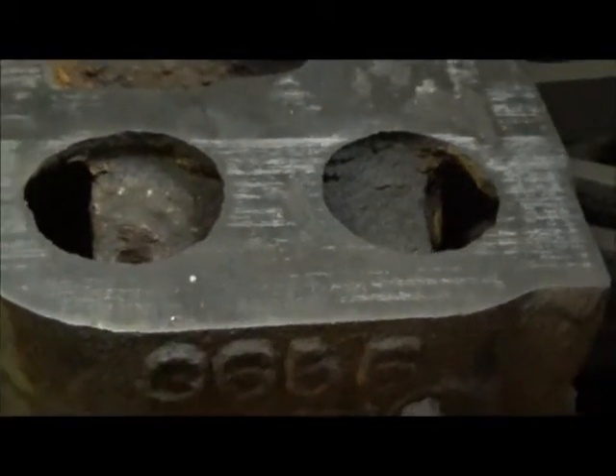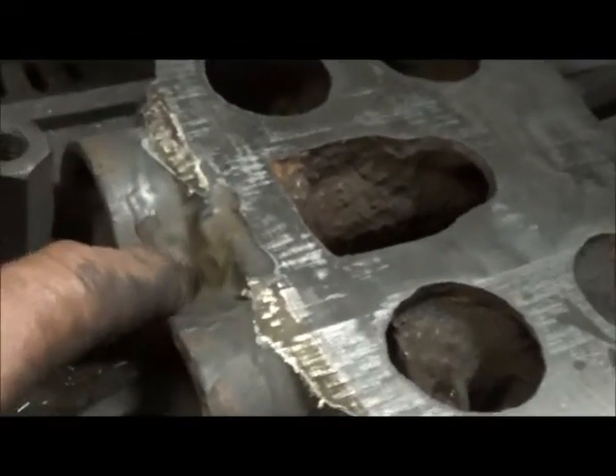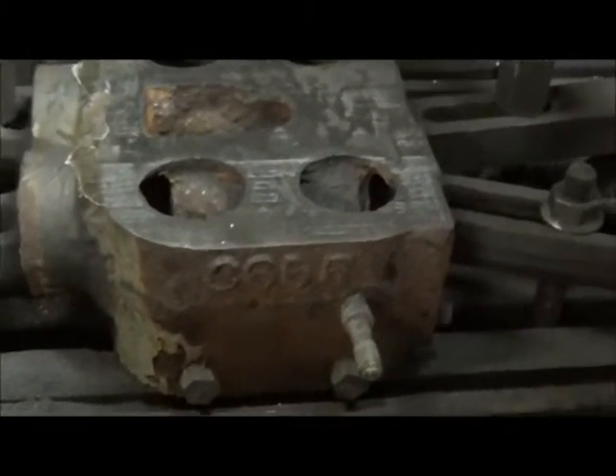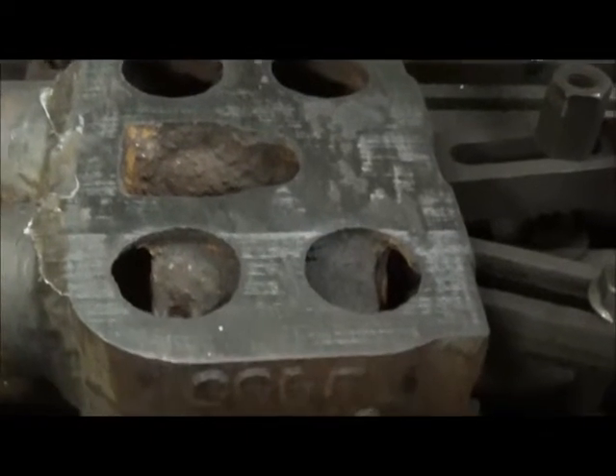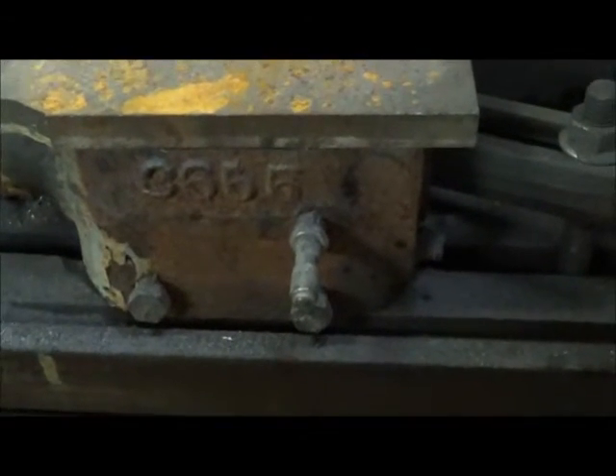I think they've done a really good job of brazing that in — I don't know why they had JB Weld over it, I don't see how it could have leaked. They actually done a real good job. We're going to leave it at that, finish that surface up, and get started on the steam chest — get the bottom done, get the lead poured, and all that. On this one when we get the steam chest on, we'll separate it in the center and there will be one slide valve on each side. I think I'm going to call it a night and we'll make another part when we get to the next one.